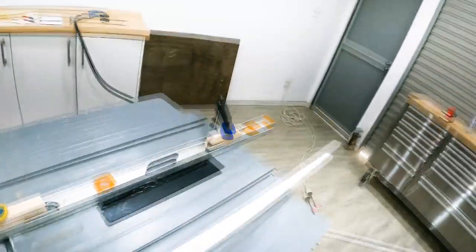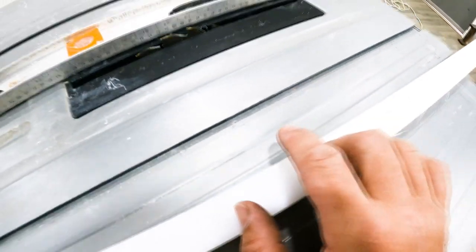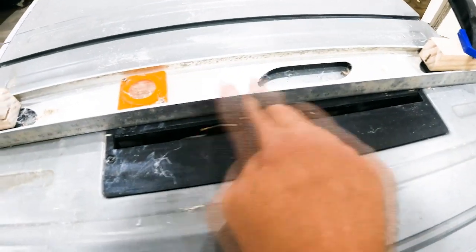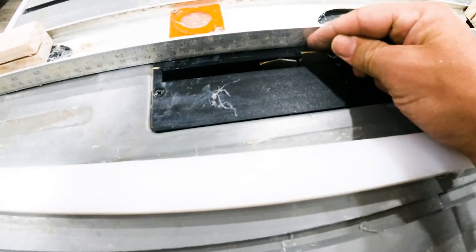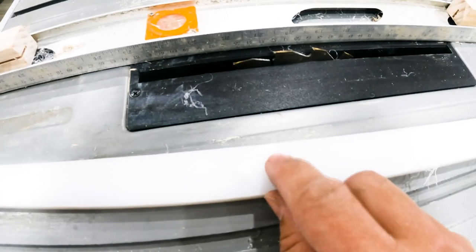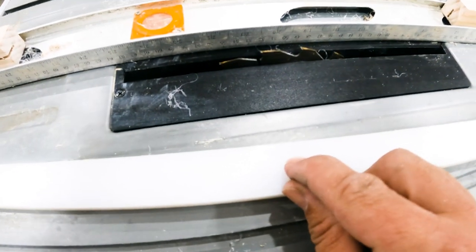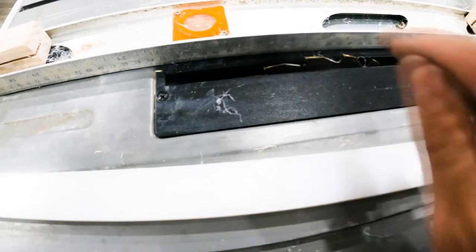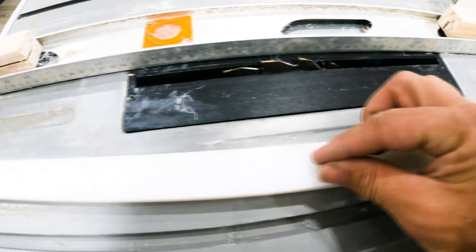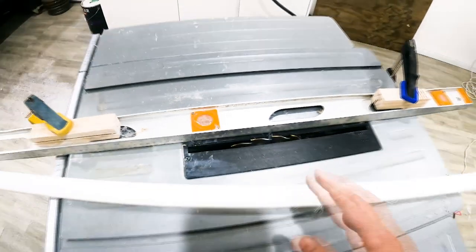It's about right. All right, so I've cut out my nylon sticks and I need to put a 10 mil slot in the middle. Would prefer to have done it with a router, but I can't seem to locate that at the moment. So I've set up my bench saw with my fancy guide, and this is basically a 10 mil offset. This is 30 mil thick. So if I've got 10 mil in between here, that's gonna put a 3 mil cut from 10 mil to 13 mil. So I'm gonna move this back another 3 mil. That's gonna get that going a 6 millimeter cut. So then I've got another one and a bit cuts to go before this will end up being a 10 mil slot in the middle. And the height of the blade is set at 10 mil. So let's give that a go.